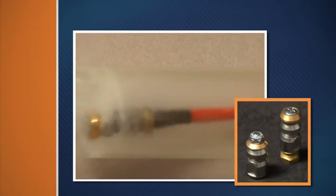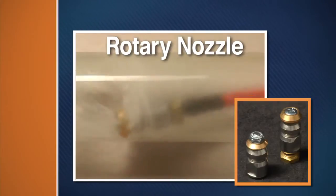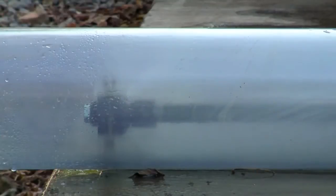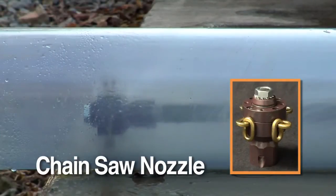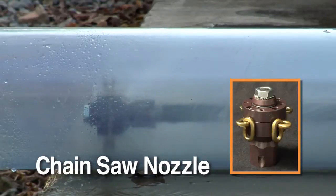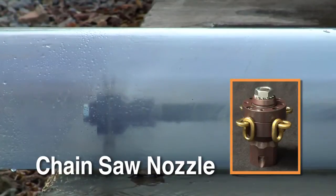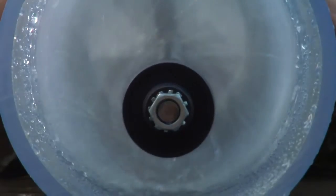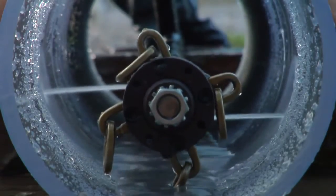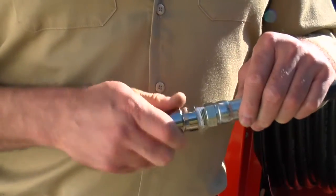Leave the lines crystal clear with the optional rotary nozzle, which scours the walls of the pipe for real wall-to-wall cleaning action. Rip through roots with the optional chainsaw nozzle, spinning at up to 10,000 RPM, easily clearing 4, 6, 8 and 10-inch lines. Chain or wire rope lengths can be quickly switched for different diameter pipes. Select the nozzle best suited for your job and attach it to the end of the hose.